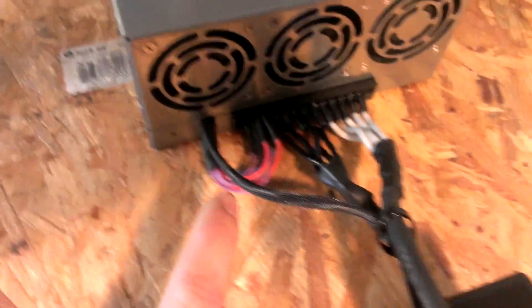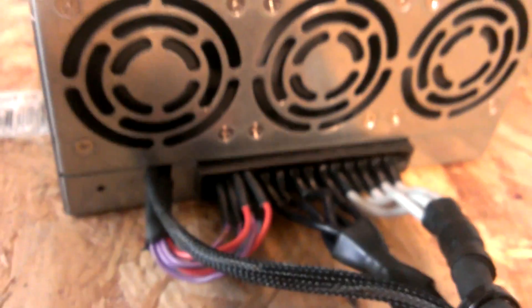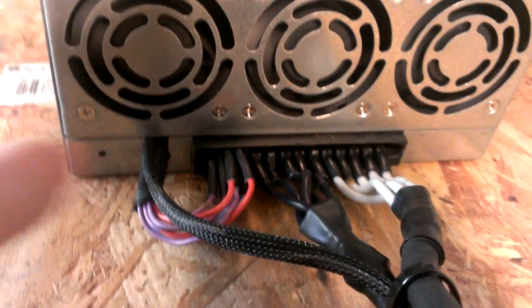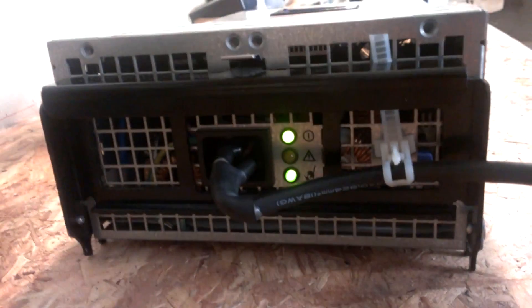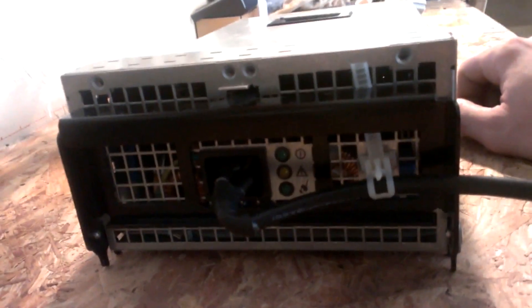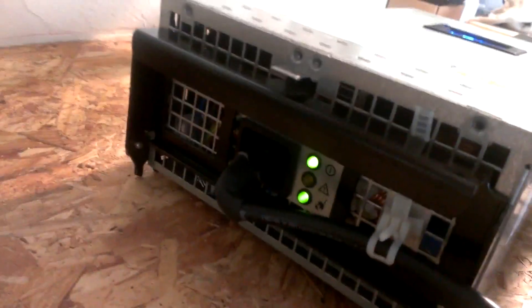These are basically the control pins over here. You can see they're smaller. Over here are the actual power pins. These control pins are the ones you're going to hook up to switch the unit on and off, for voltage control, fan control — anything you want to do is on these smaller pins on the left. That's basically it, that's how I've built it. Whenever this is on, you can see these LEDs in the back come on and let you know power's on. If I turn this off, they turn off. That one fan is still on back here — just a default setting which I kept all stock. That's pretty much it — I'll start going through pinouts and breaking this thing apart and showing you guys how I built this.